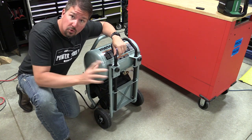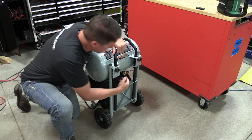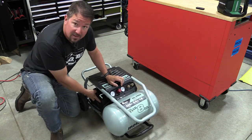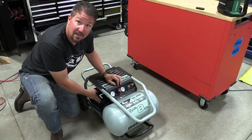Please note, if you buy this air compressor or any other oil-free air compressor, follow the break-in procedure. You're going to open the tank at the bottom, put this unit upright, hit the switch, turn it on, let it go for 10 minutes, and break everything in on the internals.